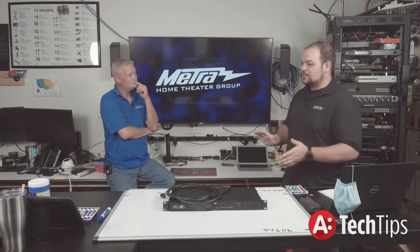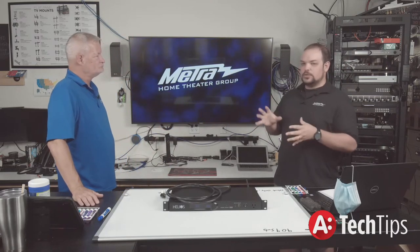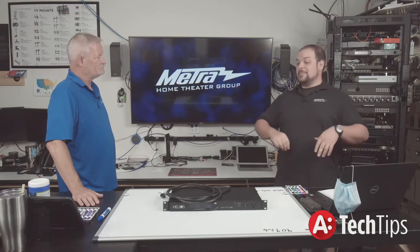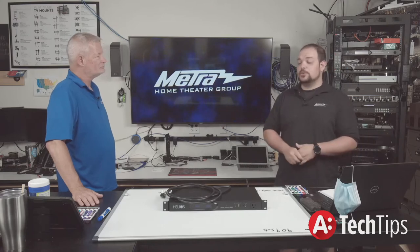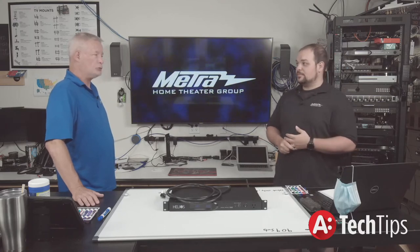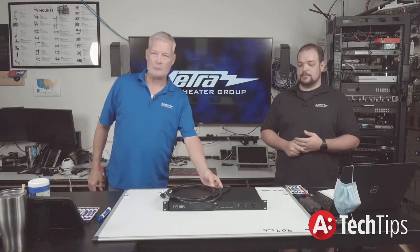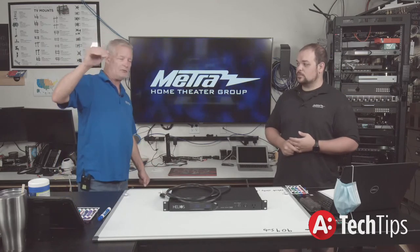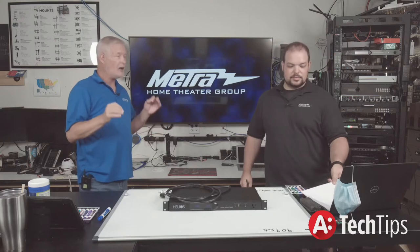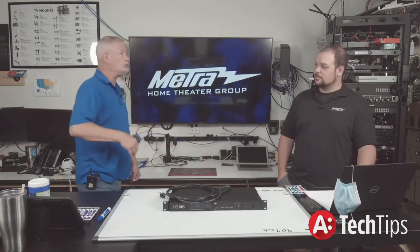The importance of all the power concepts we've talked about today and in previous episodes is that you need to take all those concepts and apply them to every type of job you're working on — whether it be a small single-room setup with one TV and a couple of sources, or a full rack system. Do not use standard two-wire extension cords with more than one device plugged into it. If you go from an outlet on a properly grounded power distribution unit to a device far enough away, and the only device on that cord is that device, you're fine. But as soon as you put multiple devices on that extension cord without proper grounding, that's when you start running into noise problems.